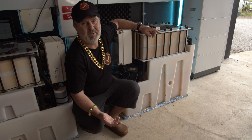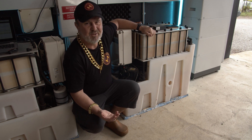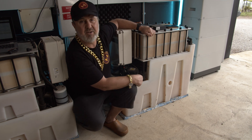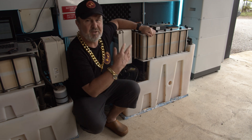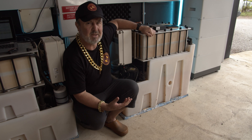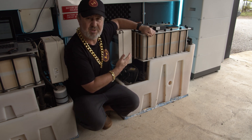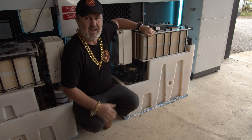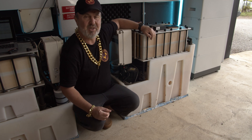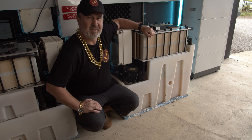Here at Mount Tilliborong at the Smart Energy Lab it's pretty cold most of the year — even in summer we're lucky to get over about 30 degrees — so boiling of bromine isn't really an issue. The reverse problem is in winter: we actually have to keep them warm. Underneath each unit there is a little heat mat, and they're also insulated on foam from the cold concrete beneath. If you're using them every day, the exothermic process during charge and discharge keeps them warm. They want to be above about 15 degrees Celsius. Sometimes it's only 5 degrees in this room, so we warm them with these little heat mats. This isn't unusual — many lithium battery systems also have active heating because they don't like to charge when cold.